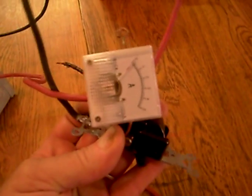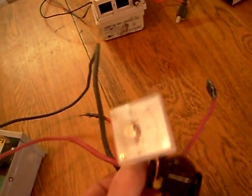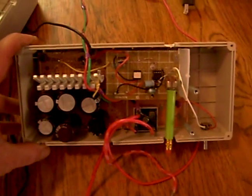I've also been working on a flash bank for it. Here's the way I do my switch on the wall — I've got my power source hooked to an amp meter right there, I flick the switch and hang that copper ring on the coil, and that's my run-battery connection. The old one is an old uninterruptible power source box that I gutted out years ago, and inside I put a cap pulser. Over here we've got the 555 timer section with something coming off the side to adjust it with a pencil.